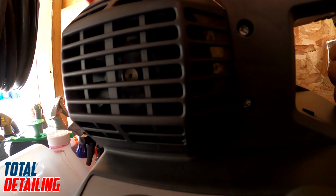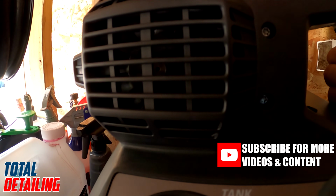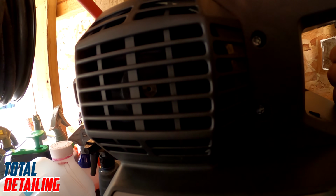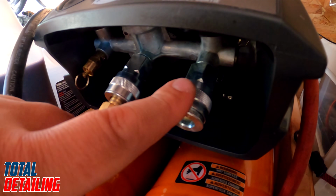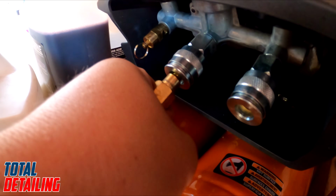It has a forced induction inlet fan. That means that the actual compressor doesn't have to work as hard to get the volume of air that it needs to compress efficiently, and it stays cooler during the compression cycle. It features 2 pre-built stainless steel quick disconnects. That means you can power more than one device at a time.